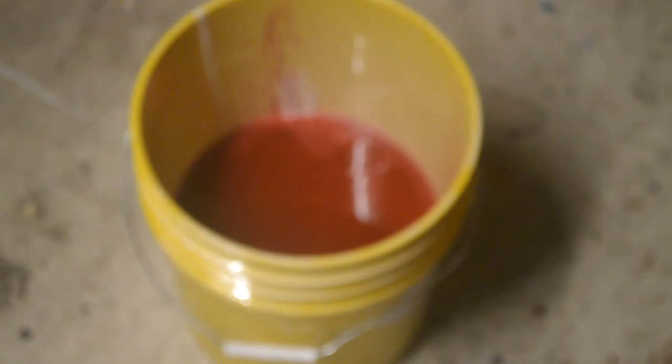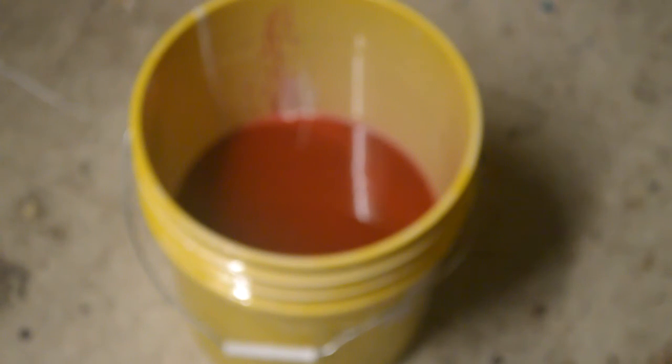This is not going to be fun — it's too deep. But that's okay because we're going to stir it around with a stick instead of by hand. Make sure she's really well blended. Try not to slop it around. You want to make sure you get that B off the sides. At the end, we should have a nice pink color. Take your time with this — this is probably the most important part of the process. If you get just straight silicone chunks inside your area, you're going to have soft spots in your mold, and that poses issues.